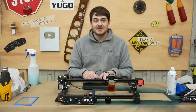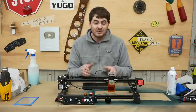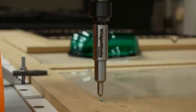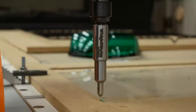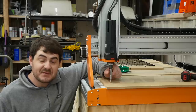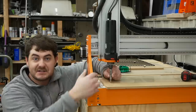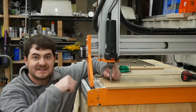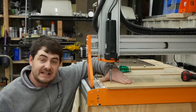Now why is that unfortunate? Because I wasn't originally planning to engrave the glass plaques with this laser. This is a diamond drag bit — it's spring-loaded and as the name suggests there's a little pointy diamond in the tip of it. This bit mounts into the collet of the router on my CNC, but the router isn't on during its operation. The CNC just presses the bit down into the glass and drags it along, hence the name. This is how I was planning to engrave the glass.